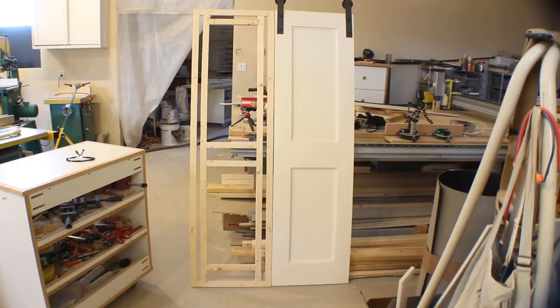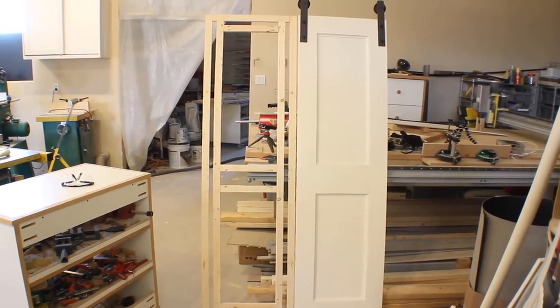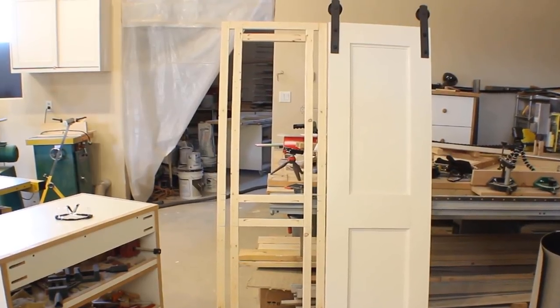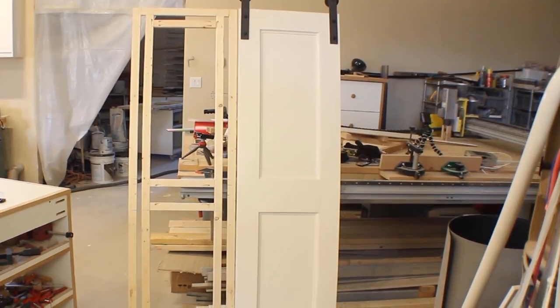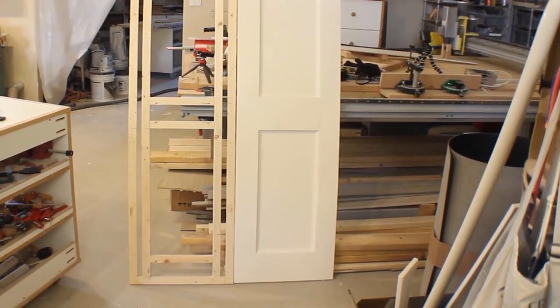This gives you a sense of where I'm heading with this concept. You have this frame that can be constructed in any configuration or thickness that you want. In my case my overall thickness of the door is actually an inch and a quarter, which is anything but a standard thickness. Then you cover the frame with any kind of material you want — in this case I use masonite and cove trim to give it a kind of raised panel look.